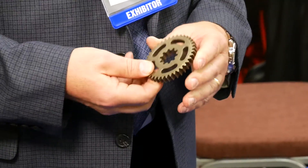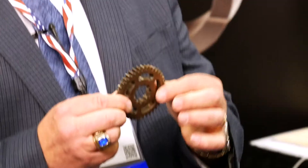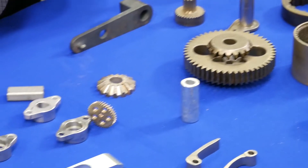This is a part that is formed in the powder metal process. There's no machining done to this part whatsoever — everything's formed in the mold. We have some holes that are molded in here to help reduce the amount of material used in this component. The process for this part: it's molded, sintered, and heat-treated, and it's ready for use by our customer.